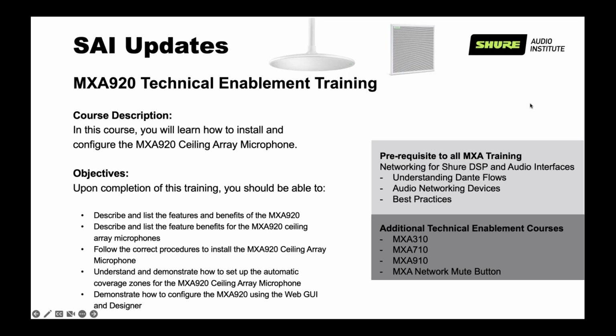We could also have it mute at different instances if you're using it for the default. So if you connect just to the 920, you could have it mute just the 920. If you connect it to the P300 or the IMX Room software, you'll be muting your entire software. The reason you would want one or the other is just in case your presenter has a lavalier microphone on, you can hit a button and only turn off the 920, giving you the clearest and most direct microphone from the lavalier. Yeah, it makes sense. That's a good feature.